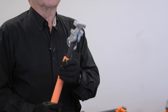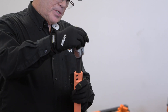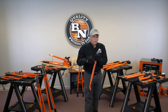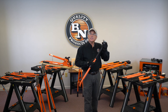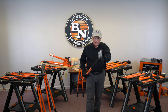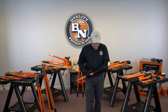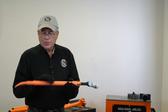Your number 10s right on up to a 16 millimeter bar inside the slot. You can see how the head will rotate 180 degrees, and as you rotate that head and lock it into place, there's a button on the side that will extend the handle. So you can see that it's much longer than your standard three-prong Hickey bar — it's real easy to bend rebar that's in place. And once you've made the bend, the whole thing can slide together and fit easily into your toolbox.